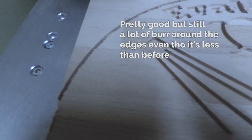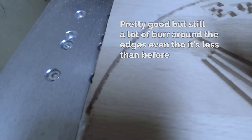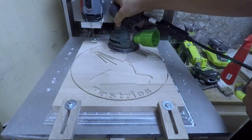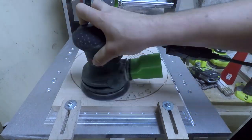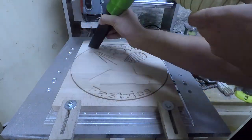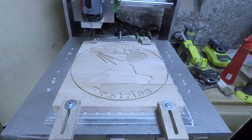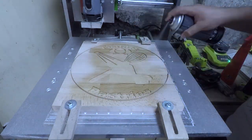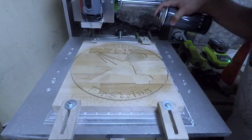With the negative inlay established, it is now time to prepare it for the resin. I use 120 grit sandpaper to knock down all the fuzz on the edges. Afterwards I use clear lacquer to seal the grain. I should have really sprayed on more coats or maybe used a clear epoxy for this — you can later see why this turned out to be a problem.